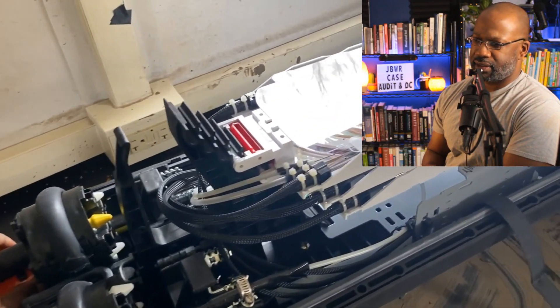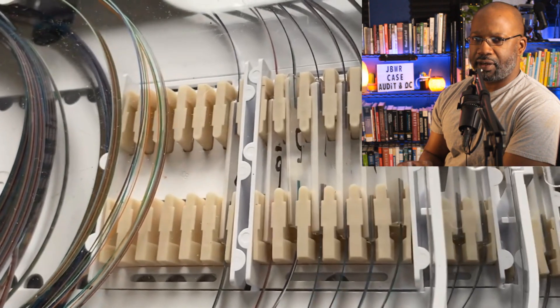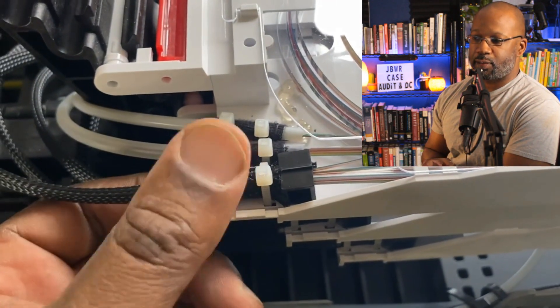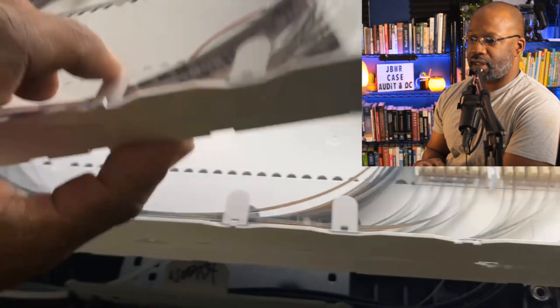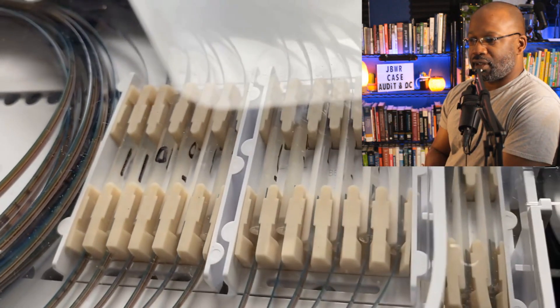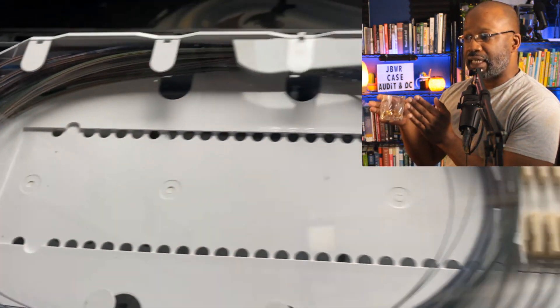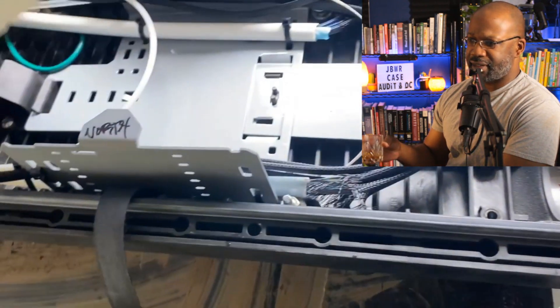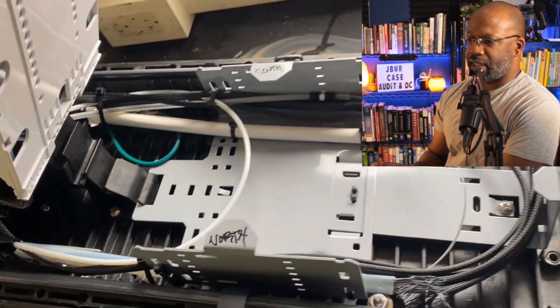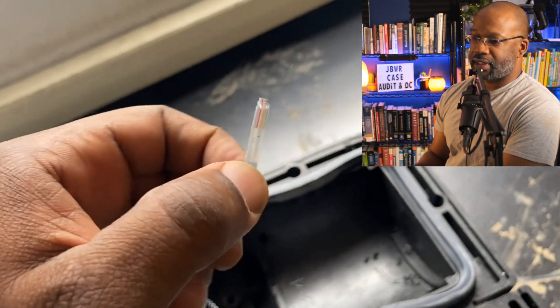Just an overview here — we see that the lid's off. We got a nice fiber loop here, the spare fiber looks very neat. We can see that there's braided transport tube here — personally I wouldn't use braided transport tube, we'll get to that shortly. We also notice that the tech took the time to label his splices, put labels on his heat shrink. We'd hope those correspond to the actual ribbons that were used. The basket looks clean, a few transport tubes, and with the exception of this one random heat shrink, everything else looks just perfect.